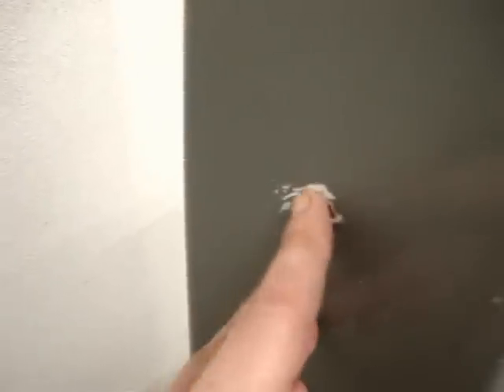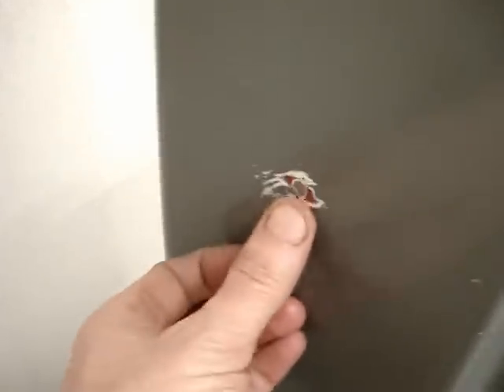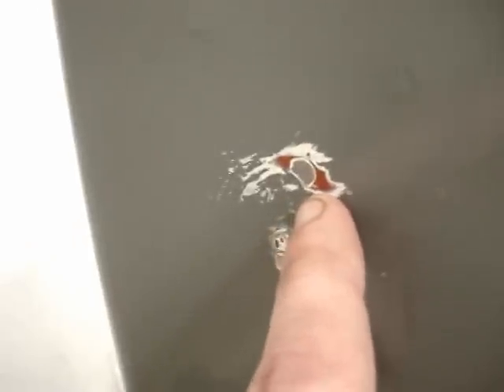Just a little follow-up here. I was cleaning the surfaces under where the labels were and I wanted to show this: there was a high spot in the casting and it looks like the factory put some kind of glue here to raise it up a little. Sometimes castings use body filler and Bondo to smooth them out, which I wasn't originally aware of. I talked to someone on Practical Machinist who has a Clausing and mentioned he glass-beaded the entire machine — he said he wished he hadn't because it opened up so much of the body filler. You can see the centerpiece is bare metal where I filed it flush, which exposed what I think is body filler used to smooth out the casting.